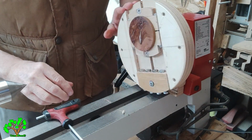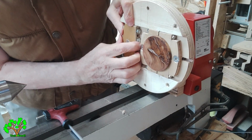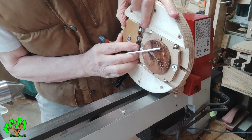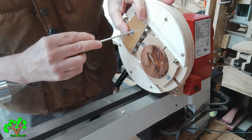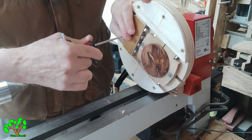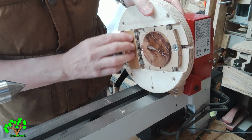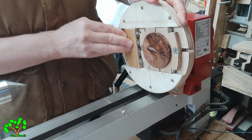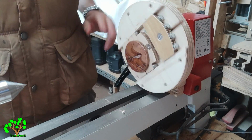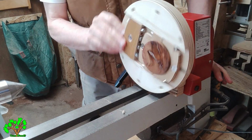The next problem is where to place the counterbalance along the slide so that the whole assembly rotates evenly, just like balancing a wheel on a car. I figured that if I put a scale on top of the base plate and put numbers on, and do a test, it would give me an approximate position for the counterbalance according to the weight of the new pendants and its associated pendant frame.